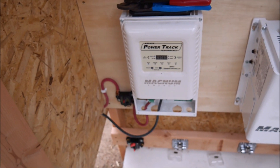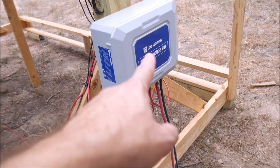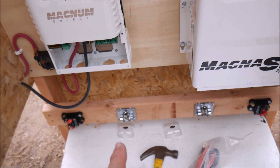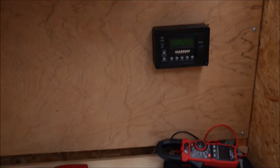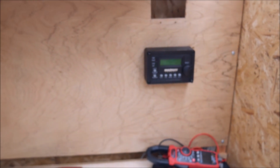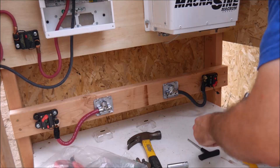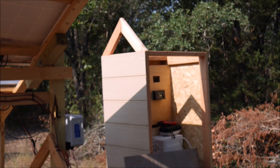Sorry, my camera's not focusing very well. I've got a breaker there for 100 amps — this has its own breaker at 125 amps, but my array won't ever produce 100 amps anyway. I've started on the wiring for the battery, and the inverter charger will be the last piece. I've got the control box mounted up there and all the wires hidden behind it. I added a 2x4 on the bottom to mount the bus bars and 300-amp breakers for the battery so I could minimize the length of the big fat welding cables I'm using. These car audio distribution blocks will work just fine for now.